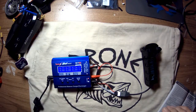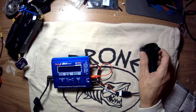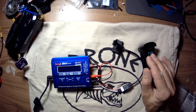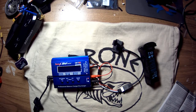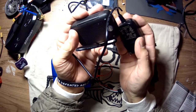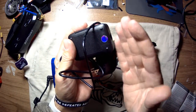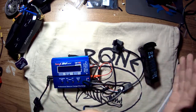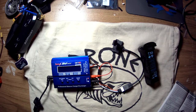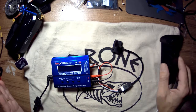What I'll do is fly this battery tomorrow, then come back and check the cells after the flight to see where they're at. Then I'll probably go ahead and charge the battery again with the Hubsan charger to see what the cells look like after that, and then maybe fly it again and check the cells. So the initial outlook is that the balance charger balances the battery very well — that's what I wanted to find out.